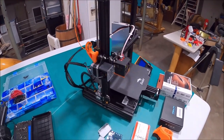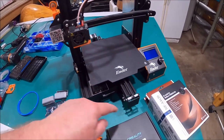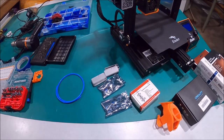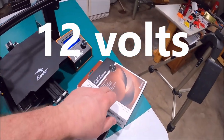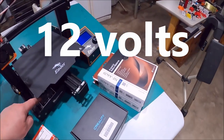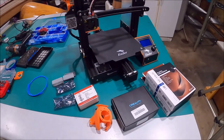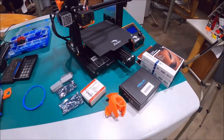Anyway, we're going to rip into this thing. First thing I'm going to do is flip this thing over on its back. I'm going to replace the motherboard and tap into the wires I need to put my buck converters on and dial them down to 12 volts so I can run my fans. I'm going to walk you through step by step as carefully as I can and get you as close up as I can to show you the detail.